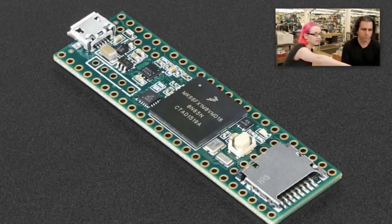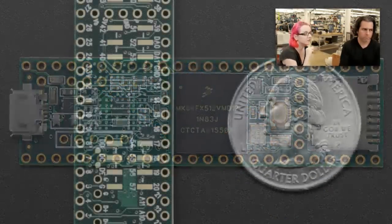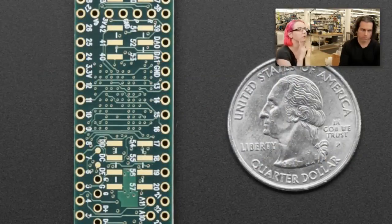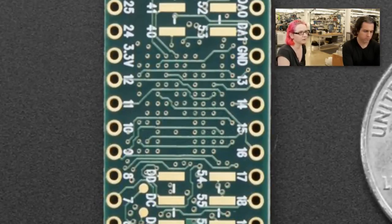And can you go back? Because the routing on this is amazing. So these use BGA processors. I believe it's a 4-layer board, or it could be a 6-layer board. And he said he was visiting here from Maker Faire. He said he spent weeks working on getting the escaping out to fit a 144 pin or whatever pin BGA onto such a skinny little board and break it out into a breadboard-friendly stick is pretty amazing. So check this out. But, you know, Paul always does such a good job with support and updates and having cool projects that I think that having one of each, there's going to be projects that come out that you want to build. So pretty handy. Okay. All right.